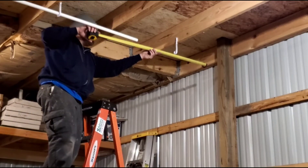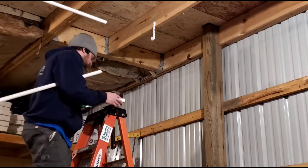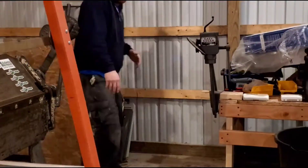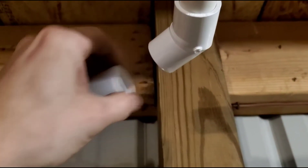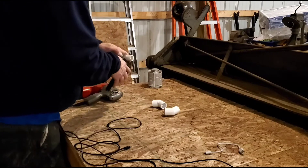We'll make this piece 32 inches long. Let's get our 32-inch piece cut. I changed my mind — I'm gonna go on the left side of that beam and we've got to move some stuff. We'll dry fit this. If we have both fittings butt up to each other, we will clear that beam. We're gonna do about inch and a half — that's where it fits snugly in both fittings. That looks pretty good.